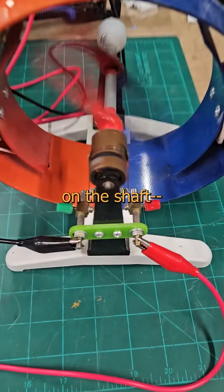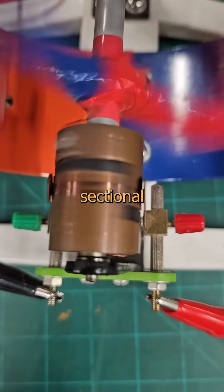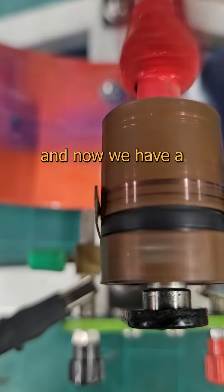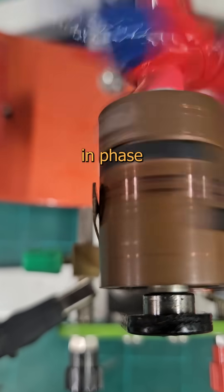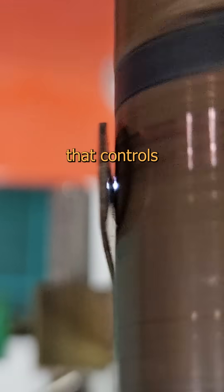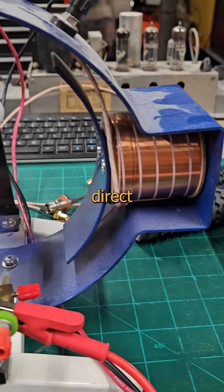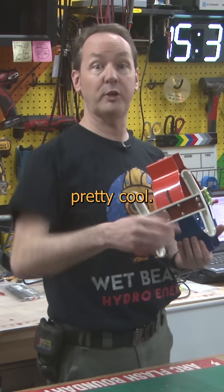This is an insulated collar on the shaft, wrapped in sectional conductors connected to the rotor windings. We place a set of wipers here, acting as brushes. And now we have a rotational switch that's locked in phase with the shaft at any speed. That controls the polarity of the electromagnetic fields — and that's how we get an alternating magnetic field from a direct current drive.